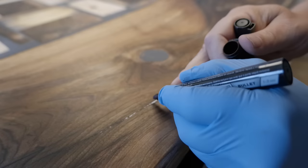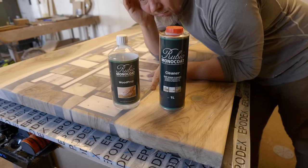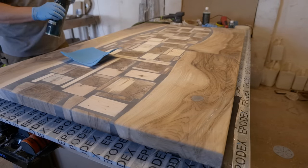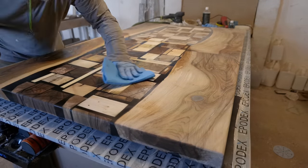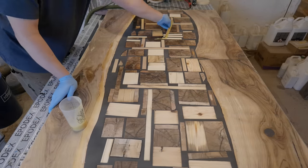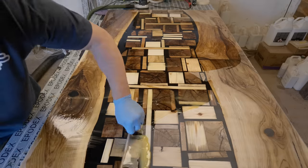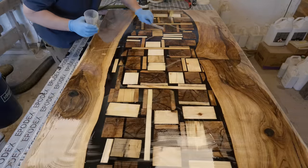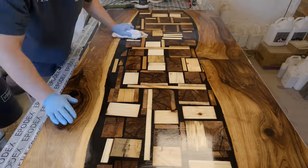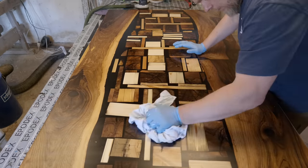After flattening, sanding and hiding mistakes with a black marker - I'm in a hurry, you know - it is time for the most satisfying part of the whole project: putting the finish on the table. For the finish I'm using Rubio Monocoat's Oil Plus 2C in the pure color. This product is essentially the same one as I used on the floor, but the pure variant is transparent and only highlights the wood's natural colors without altering the tone. It's a two-component finish that helps the oil cure faster. I always begin with finishing the underside of the table, then I turn it over to apply the finish to the top. Using a piece of wood or whatever I have laying around, I distribute the oil across the entire surface, making sure to cover every inch - centimeter. Shortly after applying the oil, I take a cloth and begin to wipe off the excess. As the first cloth becomes saturated, I switch to a fresh one, wiping the surface one more time. This extra step helps ensure a perfectly smooth finish.